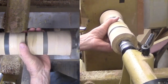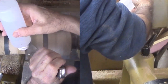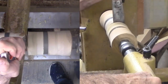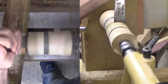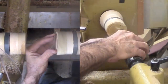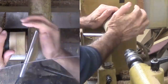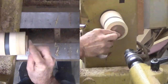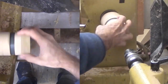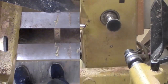I am ready now to finish the back side. I put double-stick tape on another work platform, then line things up to transfer. Since there is tape on both sides of the disk, I carefully applied denatured alcohol to the face side of the disk. This failed. But I am able to carefully place the disk on the new platform — this will be good enough for sanding. Or so I thought. I need to mount a sanding pad to the lathe so I can finish my sanding.